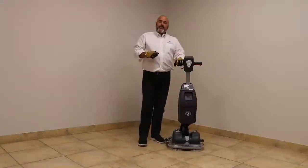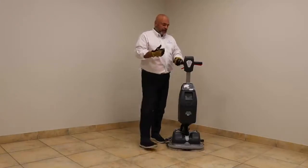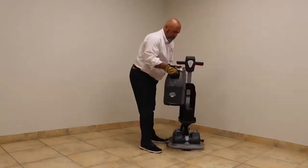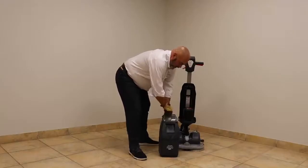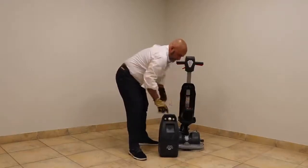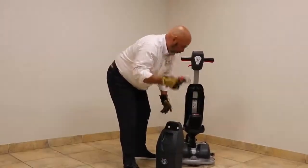Okay, so now at the end of your shift, you've used the 244, and I'm going to show you how to operate it, but now we're going to dismantle it as if we're going to clean it up. So the first thing to do is you're going to lift off the dirty water tank. You're going to set it on the floor. You're going to remove the lid. You're going to remove the float ball. Always clean the float ball.